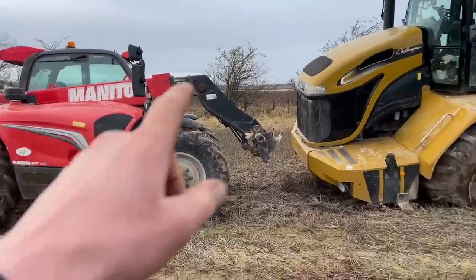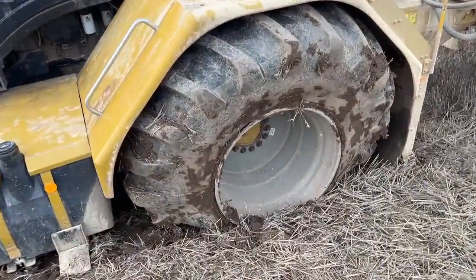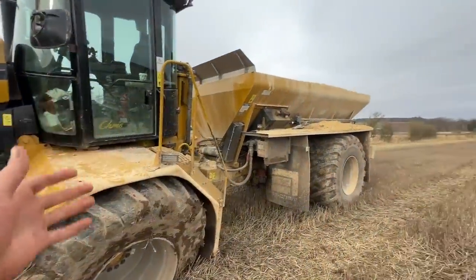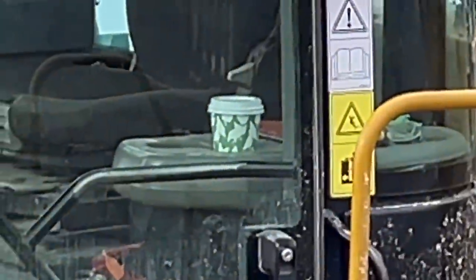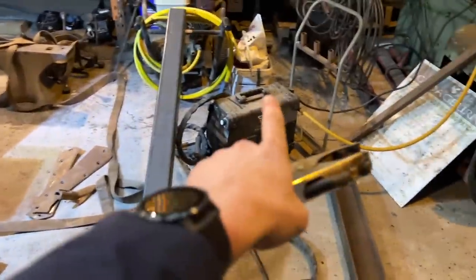The lime spreader didn't make it too far. I actually thought he was stuck — he's sitting off at an angle. He's had a blowout on one of these 1050-wide tires — massive things. They've got a spare coming; they're going to change it. There's a frame that links on the front to lift the machine up, frame goes under, and get that changed. He was only moving for 20 minutes and then bang. A couple of days ago they also had a valve giving bother — it controls the bed on the hopper. The valve was going to the closing point fine but then going a few degrees beyond closing and opening again, just enough to cause bother. Once it's done here it's back to the yard for a bit of TLC. They're also building a new one.